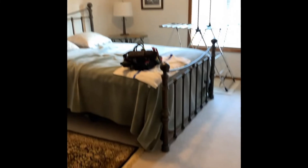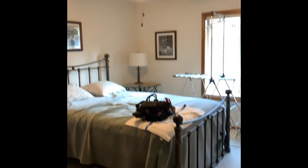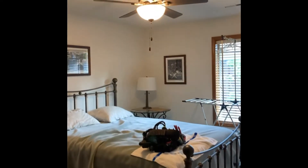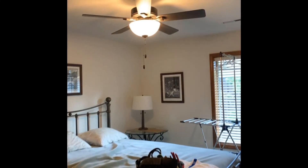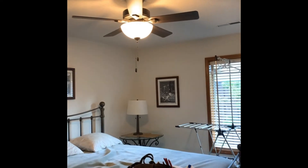After work I went over to my mom's house and hung two ceiling fans — did a live stream, so that was fun. Basically taking the two old ceiling fans down, one in my bedroom and one in my sister's old bedroom, and I'm going to put them up in my house. But I'll probably have to replace my ceiling boxes because they're not strong enough to hold the old ceiling fans — they're like 10 to 20 pounds — so I have to upgrade my boxes in my ceiling at my house so I can hang them.